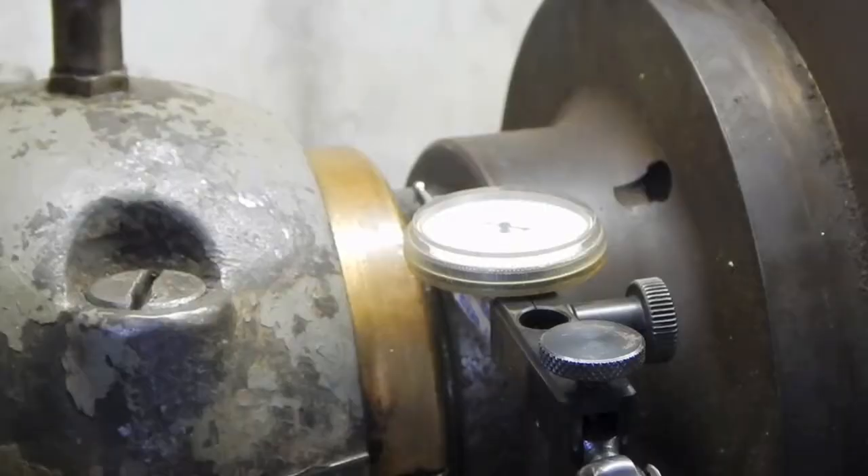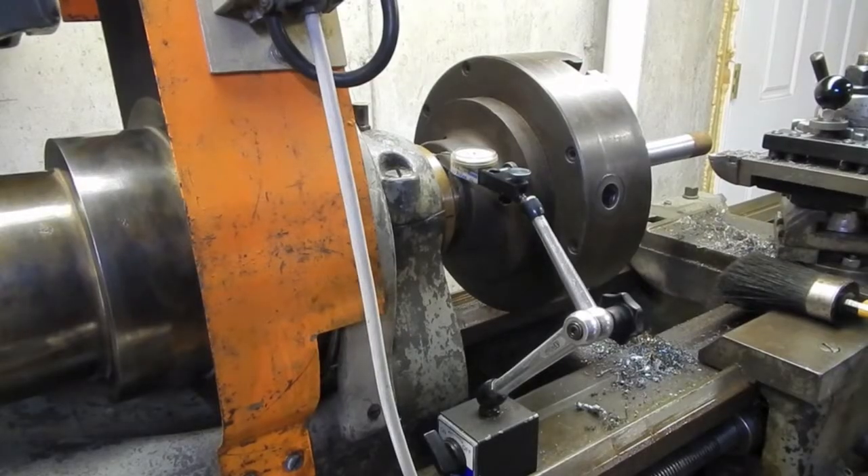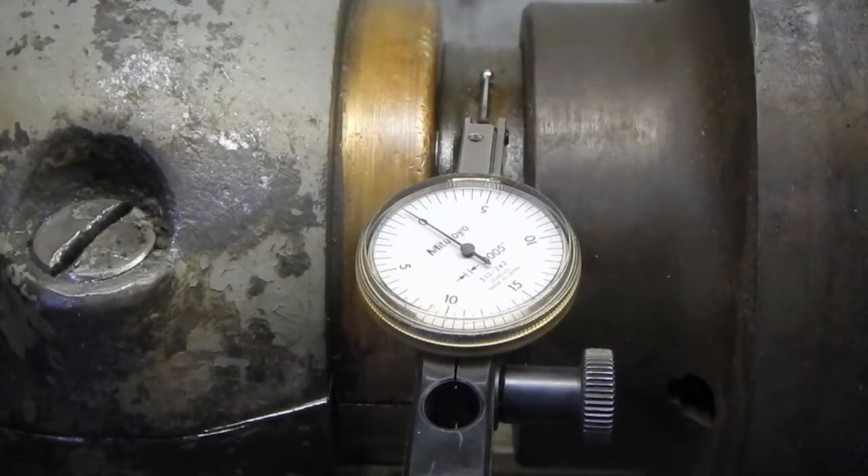This isn't a really good angle, but I'm now getting two to three thousandths up and down. Interesting - I should be able to pull another shim. I just pulled out a two thousandths shim front and back, and there's still about two thousandths play that way.